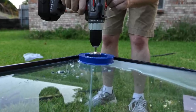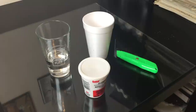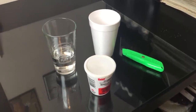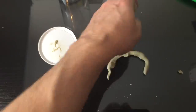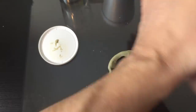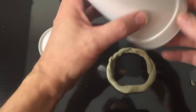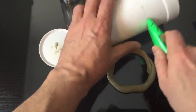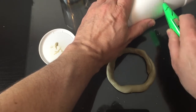There's another method I'll show you here. All you need is some plumber's putty, a styrofoam cup, and a utility knife. Knead the putty and create a ring which you place around where you're about to drill your hole. Once you've created the ring, cut the styrofoam cup with the utility knife to create a collar or dam. This is a very inexpensive solution and the dam doesn't have to be very tall — even one inch is sufficient.